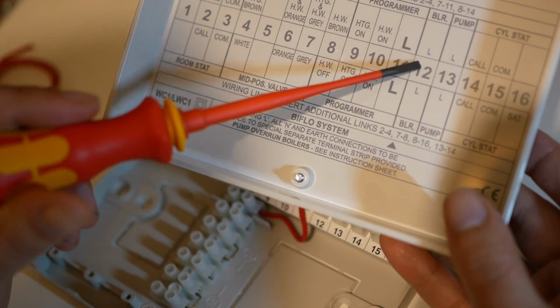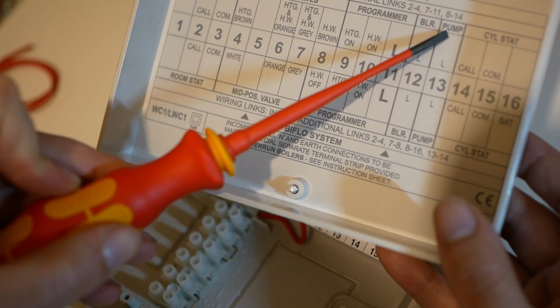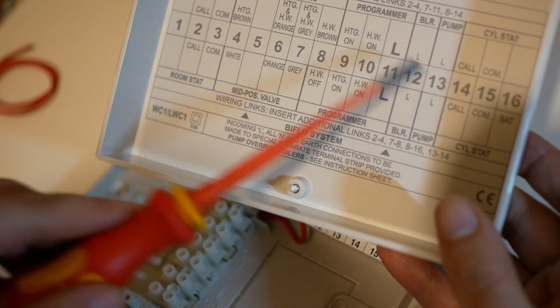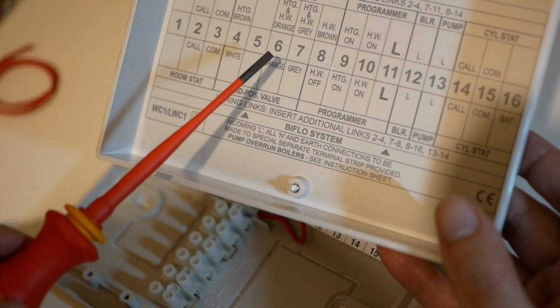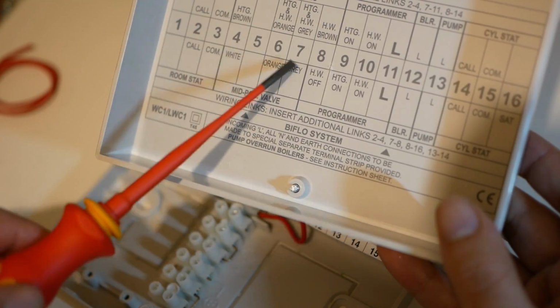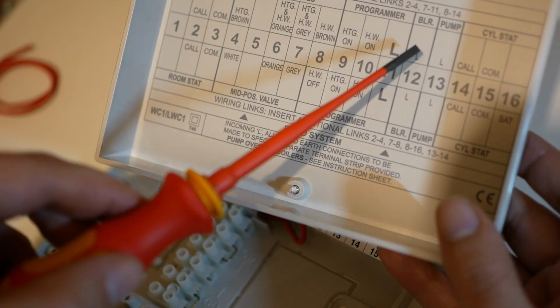Orange wire to the boiler will activate the boiler. The boiler will switch live to the pump. The pump will start. When the thermostats detect that the rooms are up to temperature, they will disengage the valves. The valves will close and disengage live to the orange, which will disengage live to the boiler.